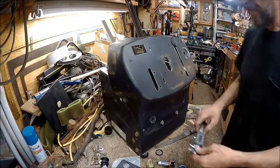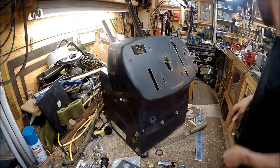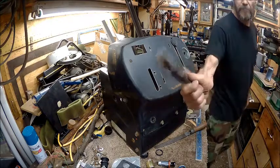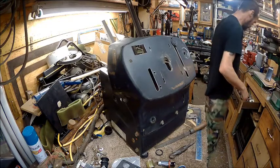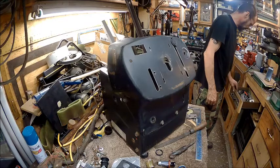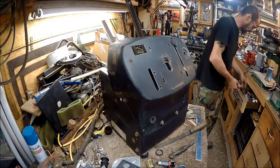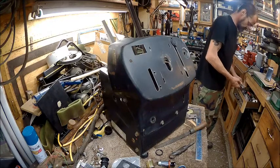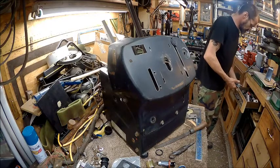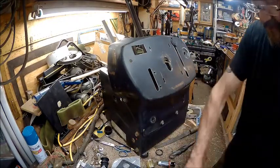All right, we're going to do a 1-inch hole. Man, I hate doing 1-inch holes. That's a big old bit, man, and it likes to grab. So we're going to go gradually with it. Hopefully that'll not be so bad. It'd be nice if I had a hole saw, but we're going to have to work ourselves down. So we're going to have to do it walking down from size to size.